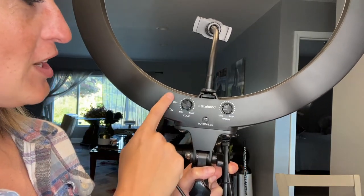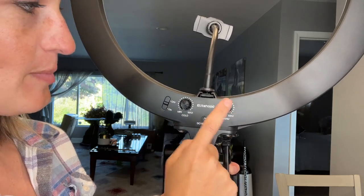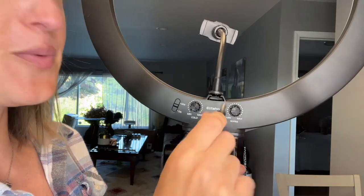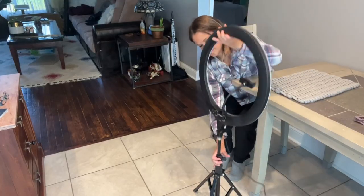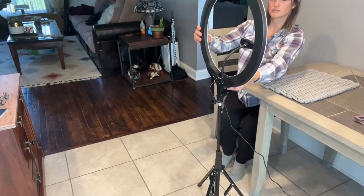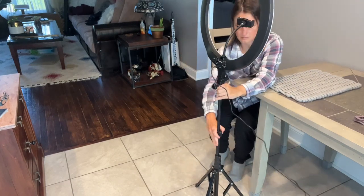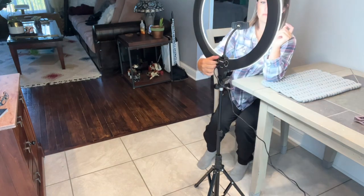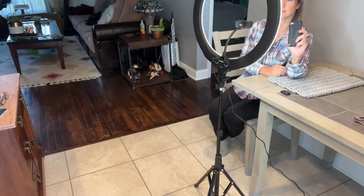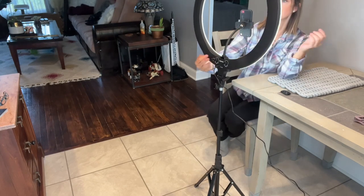Important things to note: you'll find your on and off switch, your minimum and maximum control for cold lighting, and your minimum and maximum control for warm lighting. We need to plug it in at the center right here. This has several light options and the remote control is a great addition — there are no color filters needed. We just use the two warm and cool lighting knobs to adjust color temperatures, which can be adjusted between 2700 to 5600K, and the brightness can be adjusted anywhere between 0% to 100%.